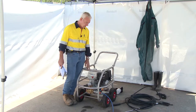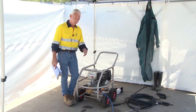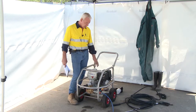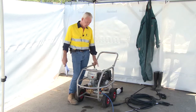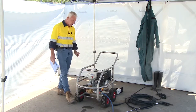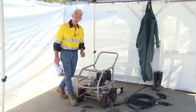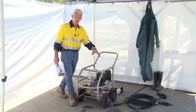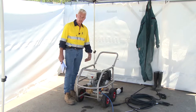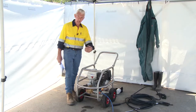The key word here is water. What we're ultimately trying to achieve is a clean substrate from water generated by a particular machine. This is a mobile machine, generally running up to about 5000 psi — this particular one is 4000 psi. It is identified on a tag or plate showing its capacity, how many litres a minute it does, which is relevant to what size nozzle we use.